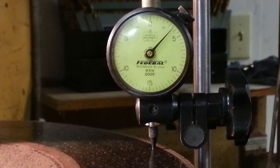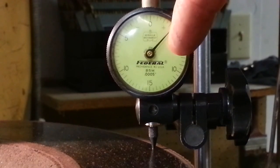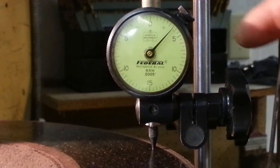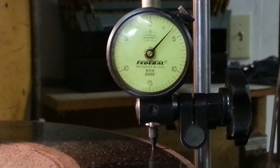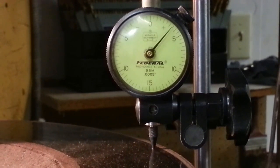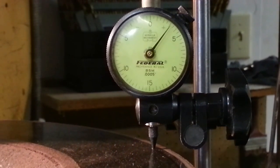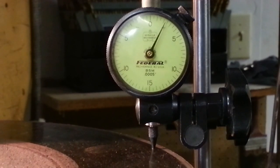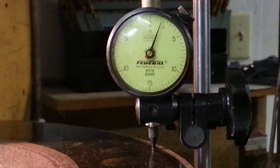Let me illustrate what's wrong with this rotor. What I have right here is a five-tenths-per-division dial test indicator — that's five ten-thousandths of an inch per division — and I've just got it mounted over here over the rotary table. Whenever I rotate the rotary table it should show you the runout. This particular rotor has about three and a half thousandths of runout on this face, which is the interface as you would see it mounted to the hub — not the side facing out. Right now I've got it mounted face down so the wheel mounting surface is facing down and bolted to the rotary table.